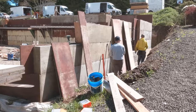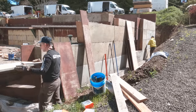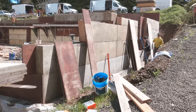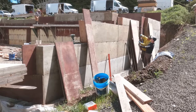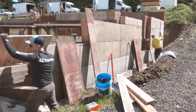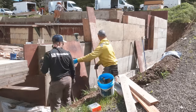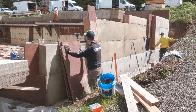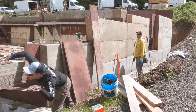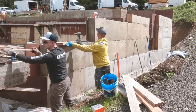On this house, it went from 10-foot to 8-foot, came across, then 7-foot, 6-foot, down to 4-foot, and turns the corner at 2 feet. The reason for that: see the neighbor on the right, that gravel? That mimics their property and the step downs on their house, as well as their driveway. So we matched our step downs as best we could to what their grade will be, because we don't want too much concrete sticking out of the ground. It's not real pretty, right? So we try to minimize that as much as we can. Then we'll just build pony walls on top of it to match the floor height, side those things, easy.